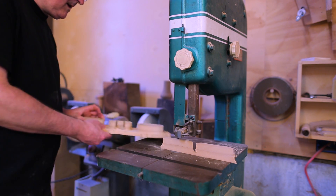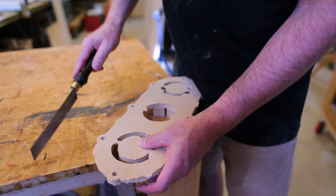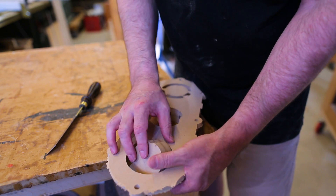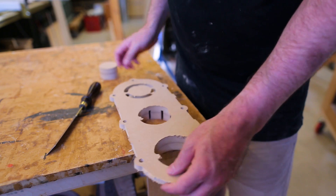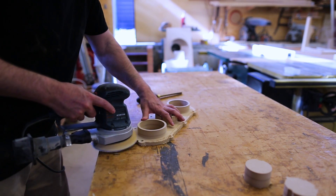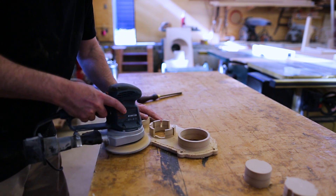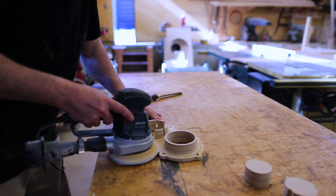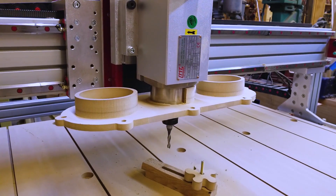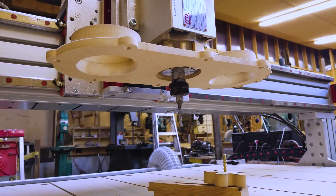The spaces for the magnets and the attachment of the bottom and the top piece seemed to work pretty well. And I figured out where I needed bridges and where I could get away without using them, working out a few of the kinks. Some of my passes that removed a lot of the volume were set to remove different amounts, so I ended up with not a perfectly flat bottom. But I figured out what I needed to change, and it looked like it was going to work.